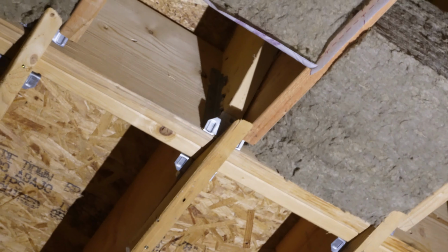So the nice thing about Rockwool is it does let you do this. Like, I don't know if you could do this with fiberglass at all. I'll be honest, I've never tried it. But Rockwool cuts kind of like cheese is the best analogy that I can make to it. So you can actually make some of these shapes and get the thing to fit nice and tight.